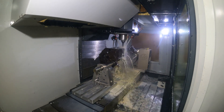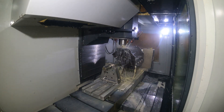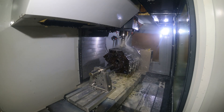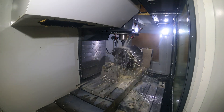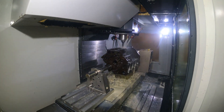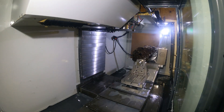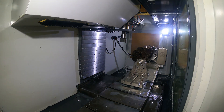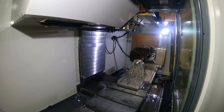And we can decide what we want to do at that point. We're just doing finish bore now and a finish pass on the chamfer. Then it's going to come in and check the bores and pop up a message. I took the tool out so that means it was too small. Basically it pops up a message that says you're good to go, you screwed up the block and made it too big, adjust the tool and cut a little more, or you're too small — which is the case here.